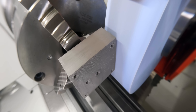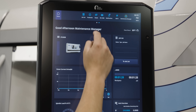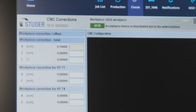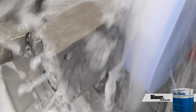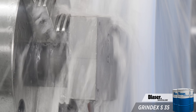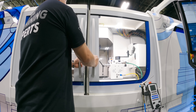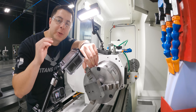Once we make initial contact with the part, we're going to kick it out, find our size, and then come back in. Right now I've got it backed off about a hundred thousandths — we're going to let it do its thing and then kick it out and walk it back in. We made initial contact with our part. We're going to let the cycle finish so we can take an accurate measurement and know where we're at, then move down to final size.